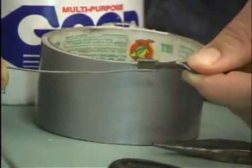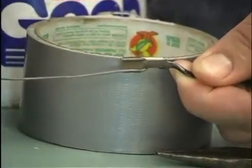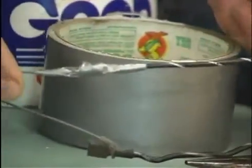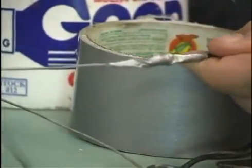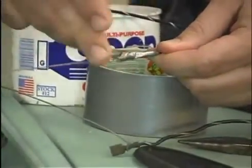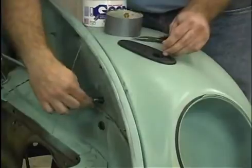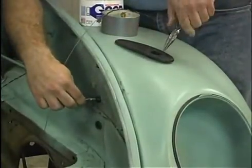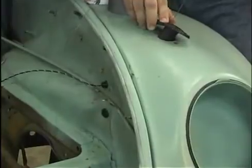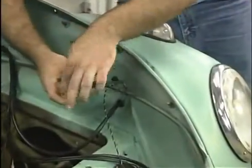Once you've got that, you can wrap it in duct tape, but wrap it lightly because if it wads up it won't want to go through the tube at all. We can lube this with some Goop hand cleaner or wire lubricant — we find this works pretty good. Once it gets up to this point you might want to grab it with some pliers because it's going to be a little harder to pull. Guide it in, pull it slowly so the rubber has time to expand, and there it is at the other end.